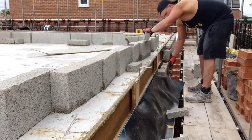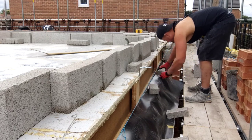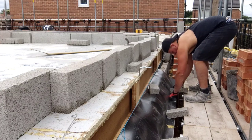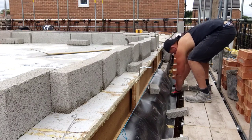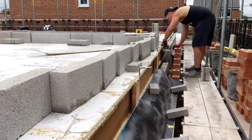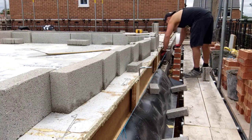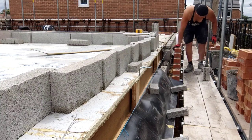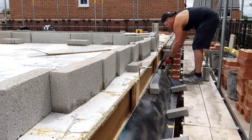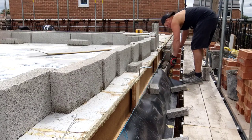It's also very important with this new stiff damp. You get it trapped properly, so it's covering the lintel, but it's not too much over where it's pushing your brick. I've had a problem before over the back of a pair. The damp pushed my first course of bricks out, the lintel won't set back right, and there are a lot of things where you have to leave extra allowances for this stiff damp.